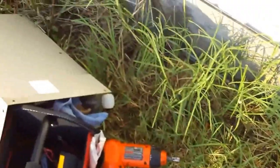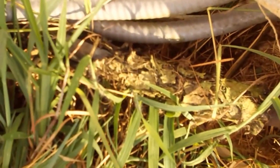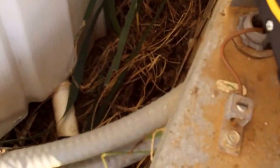All right guys, here's a quick tip right here. Now this fan motor was a three wire. The one I put on it is a four wire. Anytime you're going from a three wire to a four wire, and you're gonna keep the dual run capacitor, you will take either your black wire right here and go to T1 on your contactor. Your yellow or white, purple, whichever one your second is, is gonna come down and go to your common on your capacitor. Then your solid brown is going to come down to go to fan on the capacitor, and the brown and white will be capped off and unused.